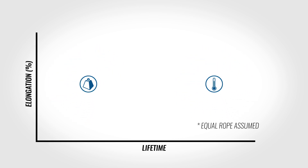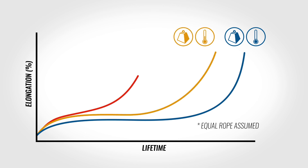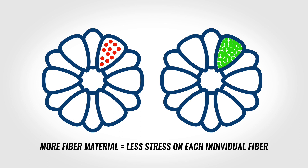Because stress and temperature dictate the creep rate of the fiber, we can analyze the rope's expected service life using these two pieces of information. Increased stress is fairly straightforward: for a given rope, higher loads result in higher stress on the fiber. For a given load, ropes made with more material will result in lower stress on the fiber. This is one reason why rope design matters in durability. Higher strand twist levels might not increase the rope's initial strength, but will reduce the stress on the fibers during cyclic loading, thereby increasing its life, all things being equal.